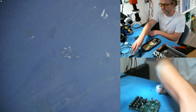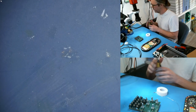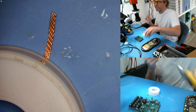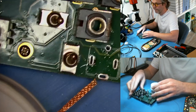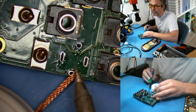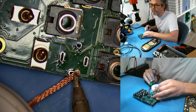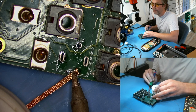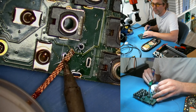Always trim off the used portion that's already full of solder to make it more effective at wicking. We just place the wick on top, put the iron on the back of it, and hold it there for a couple seconds. Looks fine.